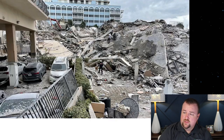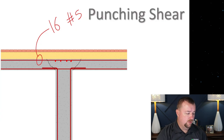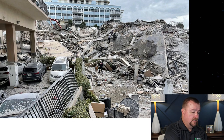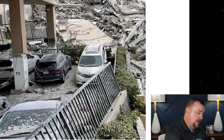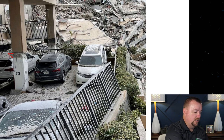Looking at photos taken immediately after the collapse, there are some interesting oddities. The shear plane I'm showing you should look generally like an inverse cone. We see a little bit of that in one tiny location, but then oddly the failure actually cuts into the column on one side, which is a little strange.